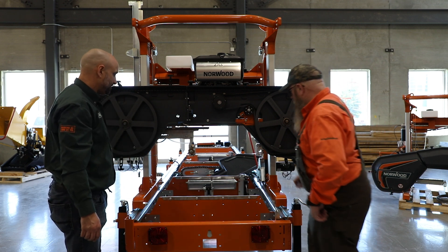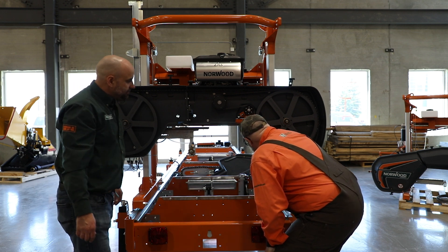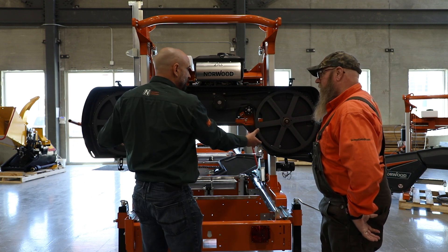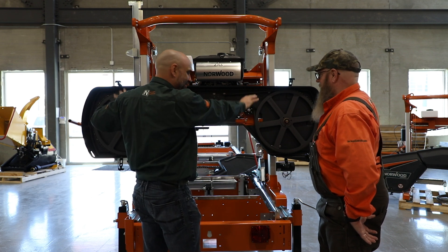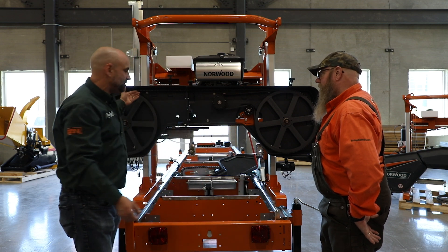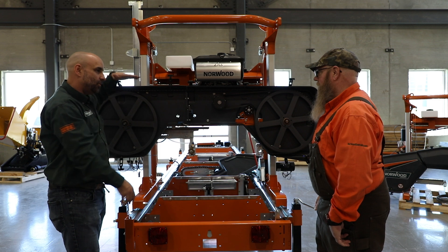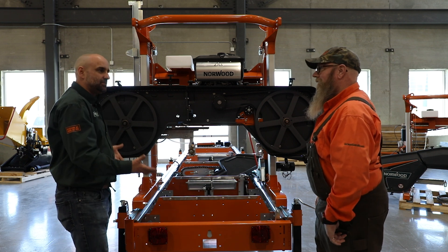This guide here looks a little tight to the guard, but there's some adjustment up and down on that guide. One thing to check is when you have your guards on your sawmill — a lot of times when we mount our guards, the bolts are at the bottom location. If you find it's hitting the guide on the non-operator side, you might want to loosen the bolts that hold the guards on and just raise them up — give yourself a little more clearance. Lower the saw head all the way down until the guards hit the lower side frame, then just push it up a bit. Some guys will put a little spacer in there to push them up.